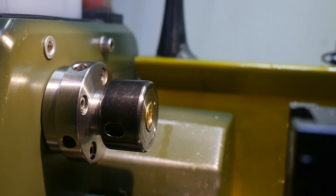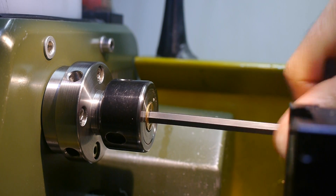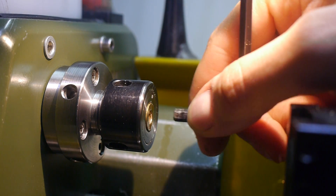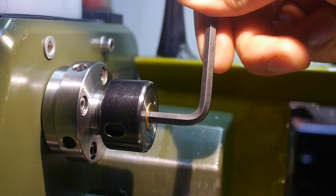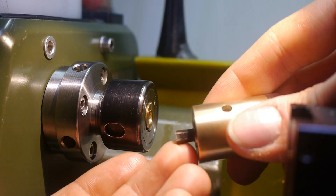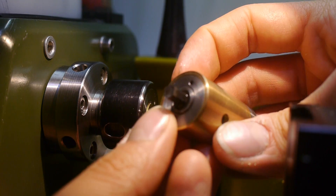Let's pull that out of the way and let's see if it worked. Yep, worked — no problem. And the actual key goes in about 5mm, which is about how deep I broached. It's actually quite tight. I made the broach a little bit smaller than the maximum no-go size. And the actual broach looks okay.